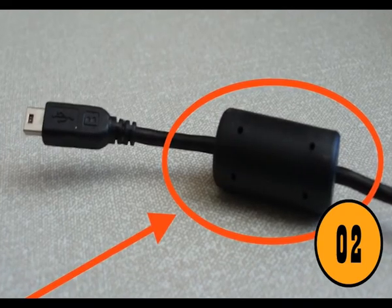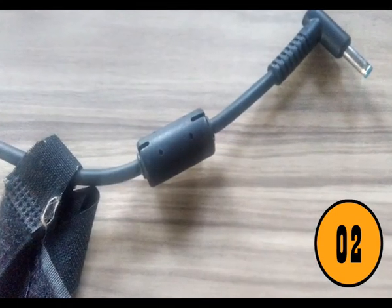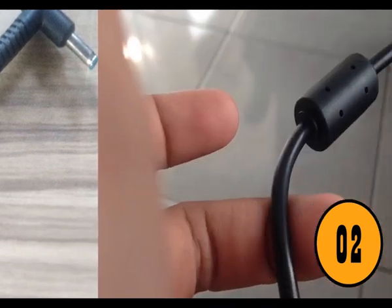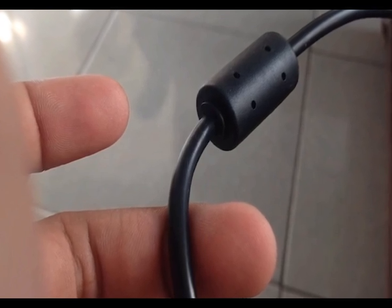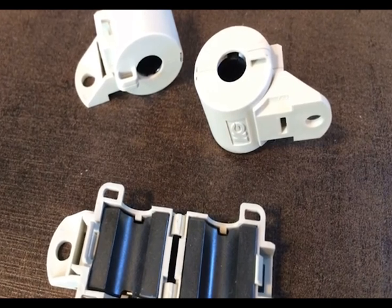The Cylinder on Your Laptop's Power Cable. Most people see the cylinder on their laptop's power cable every day and have no idea what it's for. Some believe that it's for decoration. It's called a ferrite bead, and it suppresses high-frequency noise in the electrical circuits. The design is quite simple – it's made from ferrite and it's wrapped to protect it.